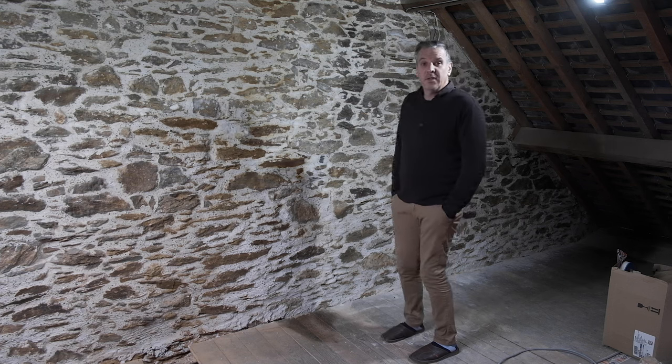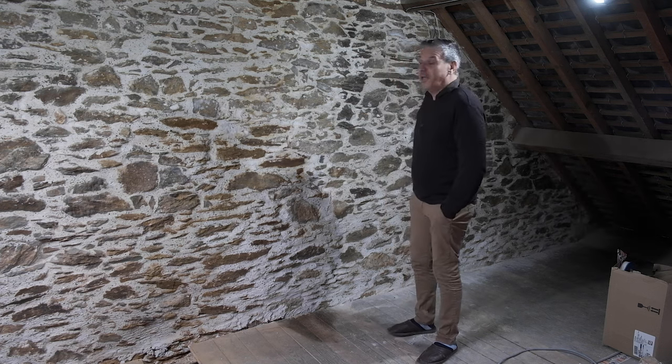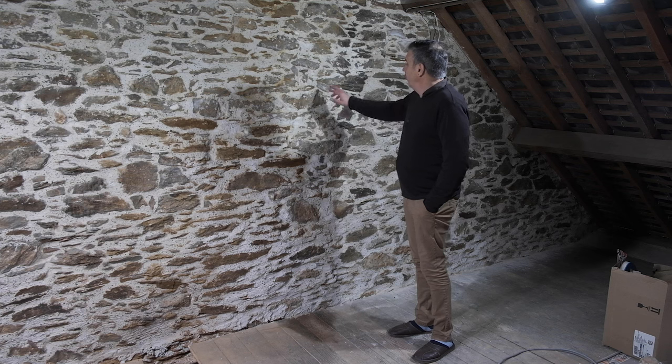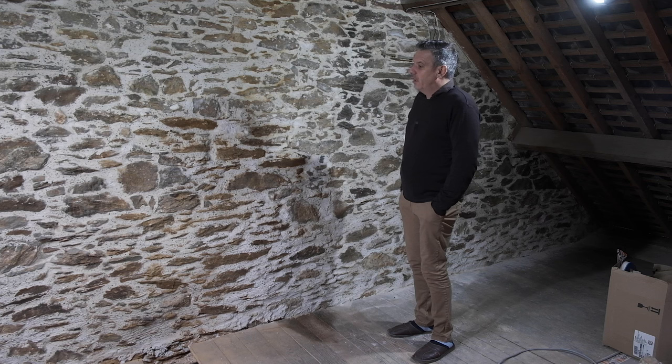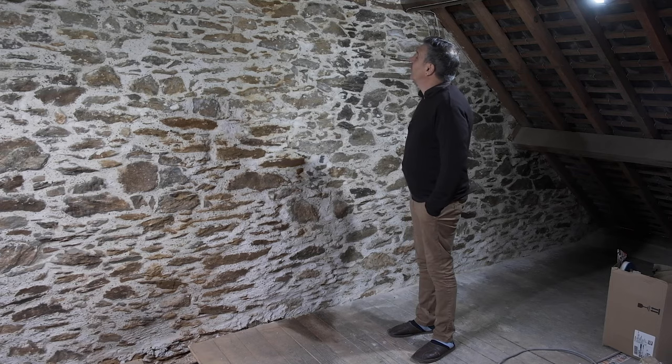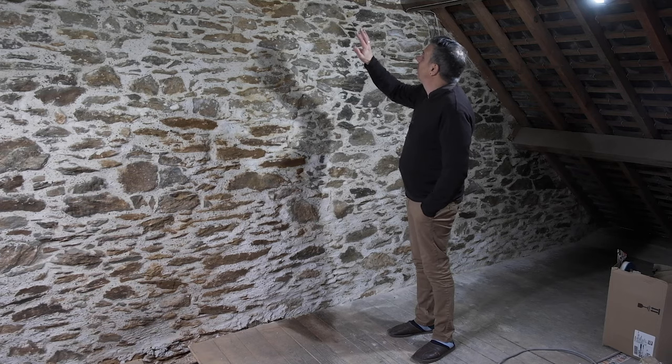So the wall is done. It took me a while. If you're familiar with our channel, you'll know that this is a lime mortar, a non-hydraulic lime, sorry, a natural hydraulic lime 3.5 with a quite coarse builder's sand, and it gives us a nice finish, although this wall will be hidden eventually. But it's a great improvement, and you can actually see that the stones are sort of drying out.